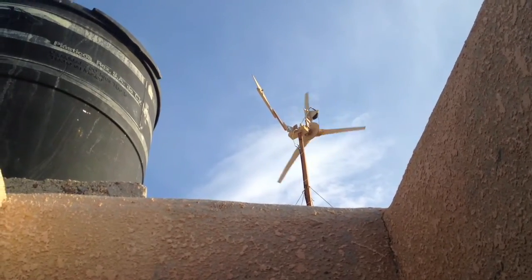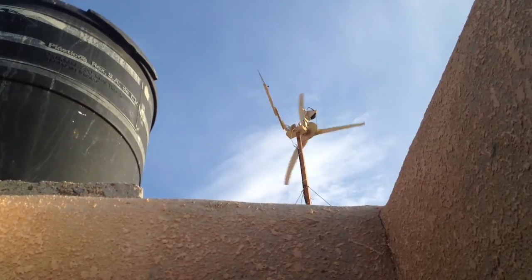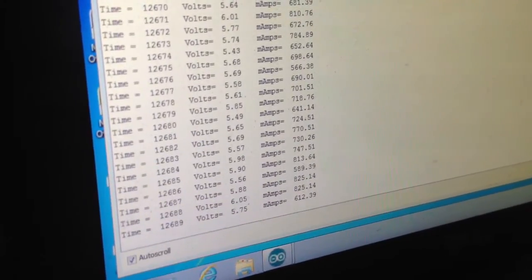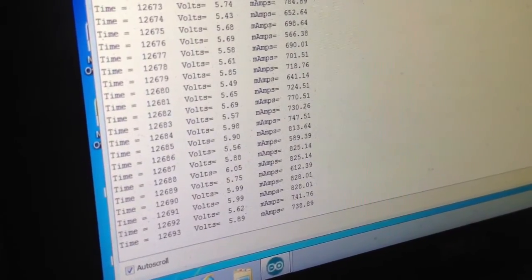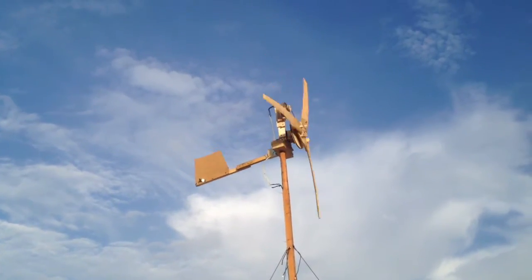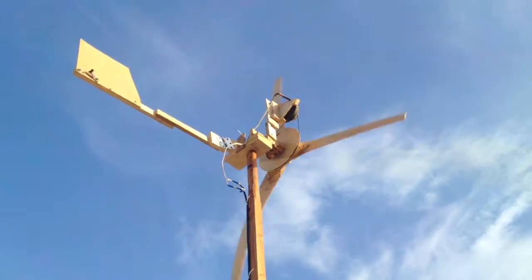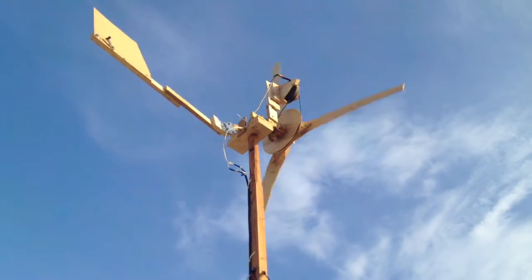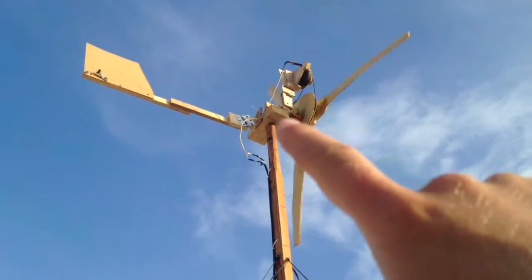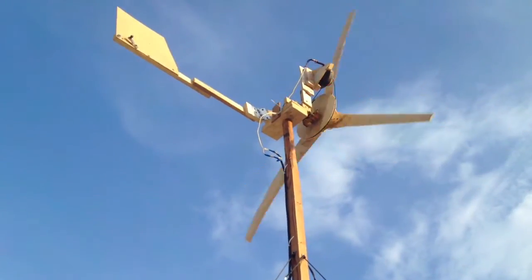The furling is really saving us from exploding. The turbine is reading 600 RPM, then 825 to 828 — very constant and very strong. This whole system is less than $10. It's been spinning like this off and on for pretty much 4 hours. This tiny little belt made from thermo-shrink plastic tubing for electrical projects — it's amazing how many revolutions it's done, how much friction is on this belt, and it hasn't snapped or fallen off yet. You just need to line the pulleys up perfectly, make sure there's enough tension and the groove is deep enough in both pulleys.